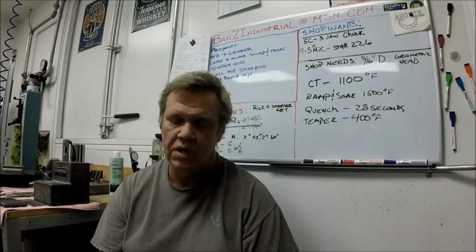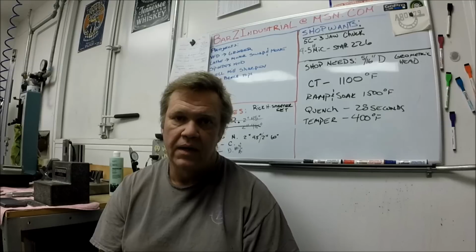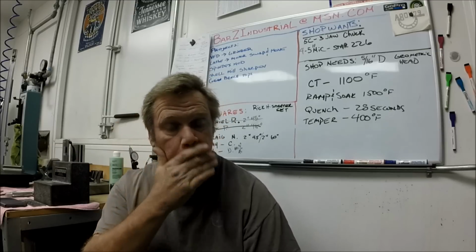That 28-second quench really made the warpage problem go away. They just cool down nice and neat, and actually there's no smoke like that other 5-weight oil we were using.